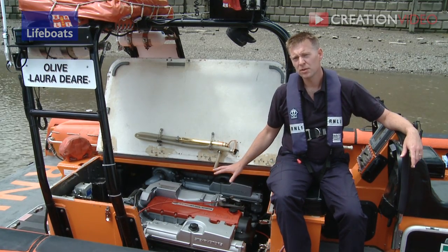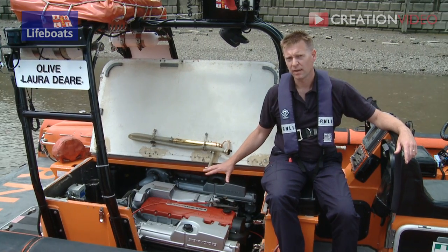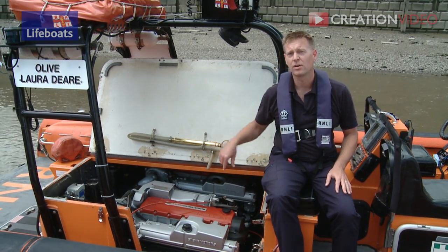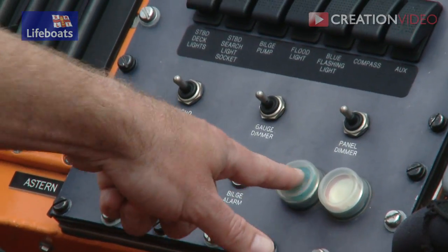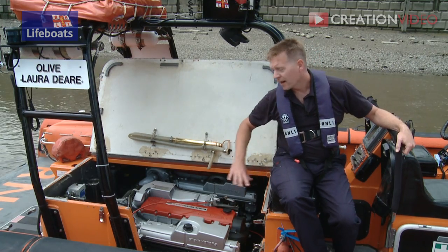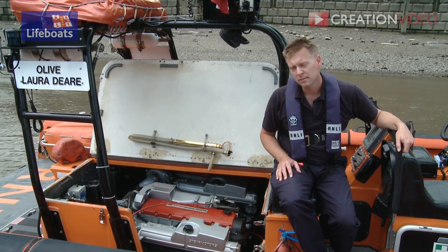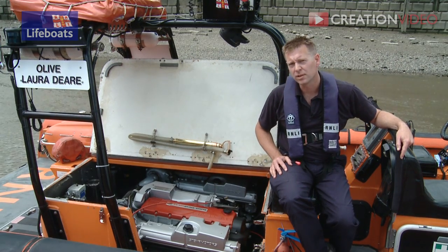Once you have checked the engine without it running and you're sure that everything is tight and that there is no leaks anywhere, you're ready to start your engine. Make sure that you stand back so that no loose-fitting clothing or anything else can get caught in the moving parts. Start your engine and again recheck it visually. Make sure all of the belts are moving properly and that they're not slipping. And make sure again that there are no leaks throughout any of the engine systems.